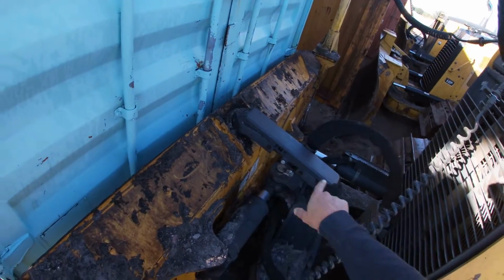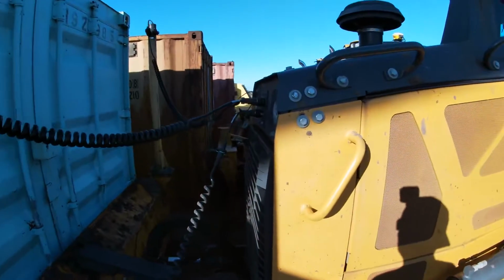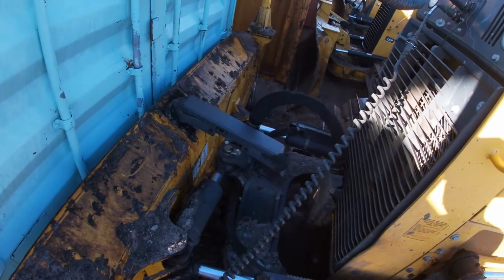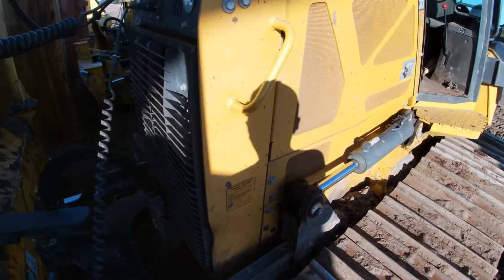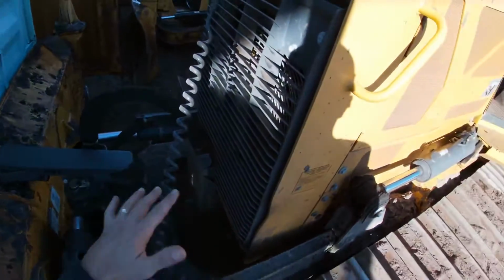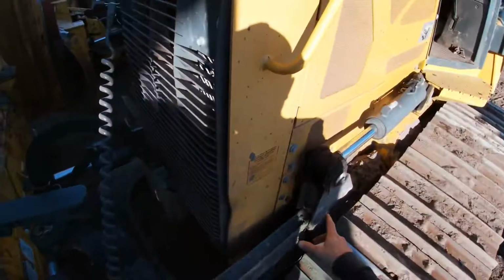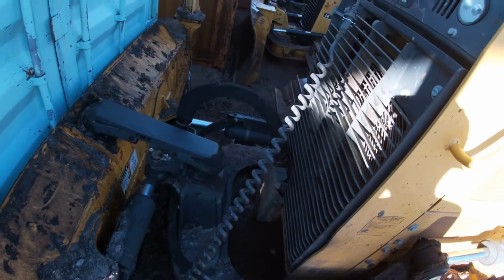All of the grease fittings we're going to inspect and grease if we have the opportunity to grease. If we have a fuel man or lady that's going to come later, obviously we're in charge of this machine. So don't just sit in the machine while they're greasing the machine. Even if you're union or something like that and it's not your job, it is my job as the operator to make sure that all of these fittings get greased. So I can just walk around and chat with that person while everything's going on and just say, hey, you forgot one, or don't forget this one, it's squeaking. Whatever you have to do to get the machine greased, let's get it greased.